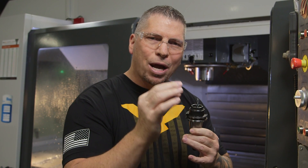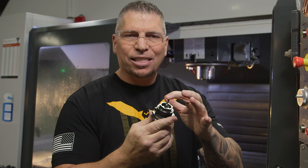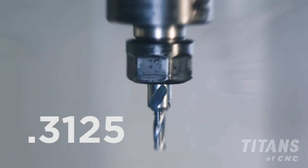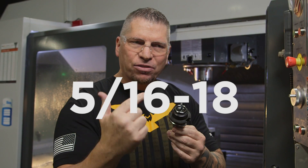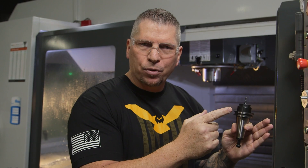That's why we're putting out a lot of G-code manual programming videos. So the 5/16-18 means the OD, or outer diameter of the thread, is 0.3125 — that's the 5/16. The 18 is how many threads per inch. I need to document that information because without it I can't create my program.